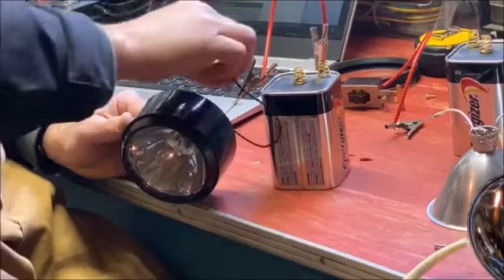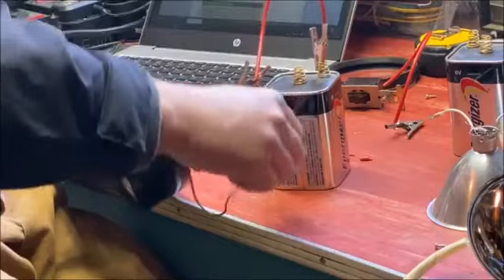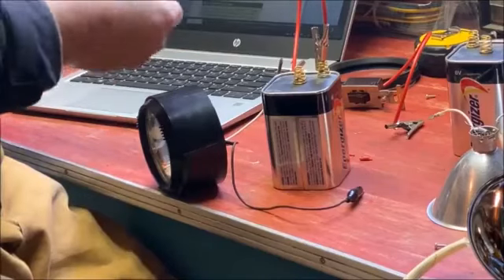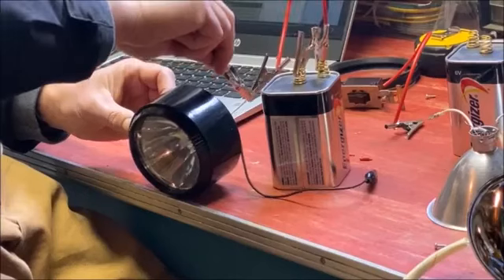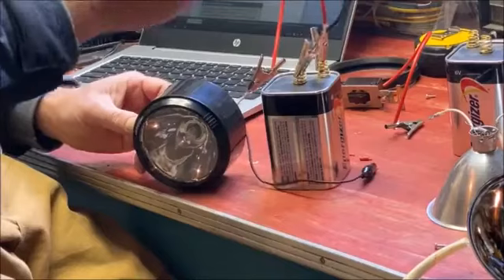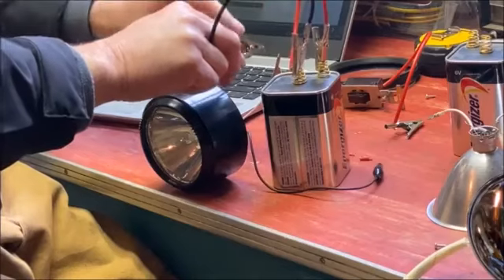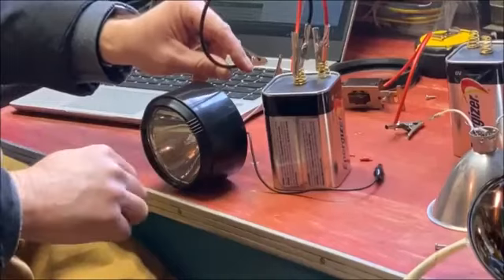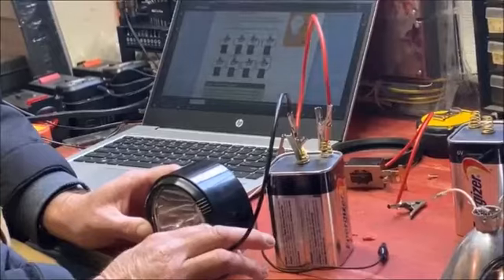For bottom middle left, the ground or negative wire is connecting at the same point as the positive. You can see the light isn't on, and we definitely would not want this left on very long, because the circuit would actually go from the battery to the negative and straight back to the battery. This can cause the battery to overheat and explode.